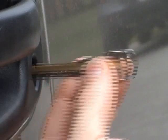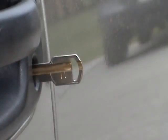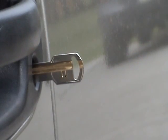Now we're getting out toward the end of the lock, so we're going to switch over to our other key, which lets more of the key be inside the lock — as with all the rest of our tools. We're going to start by inserting it all the way back in, and that's automatically going to be in the 5 position. So it's got number 5 trapped right now and we're going to go ahead and read number 5, starting with the 4 depth again.